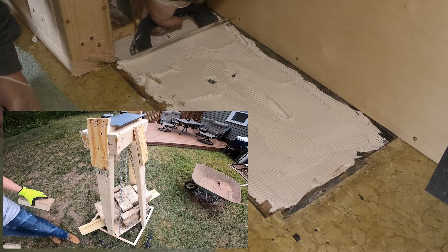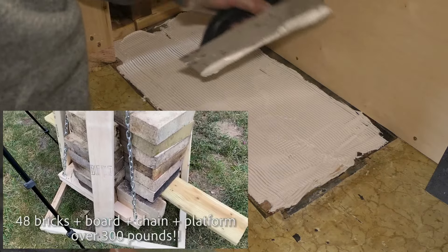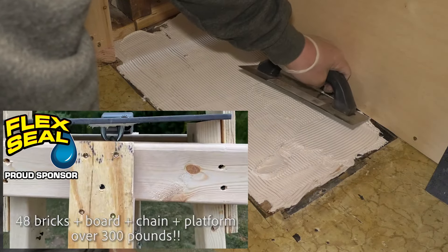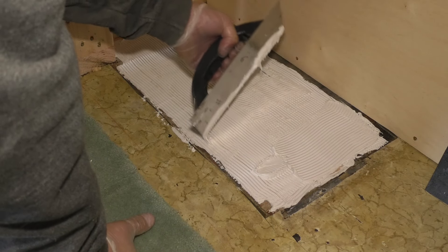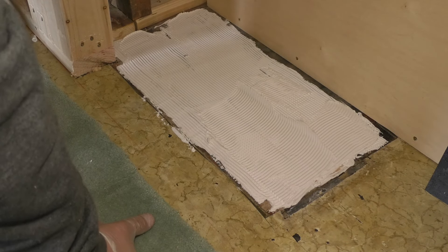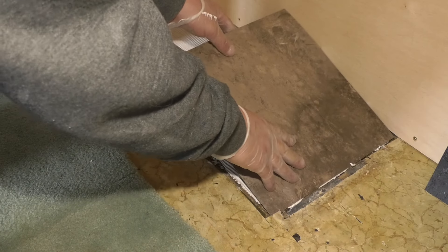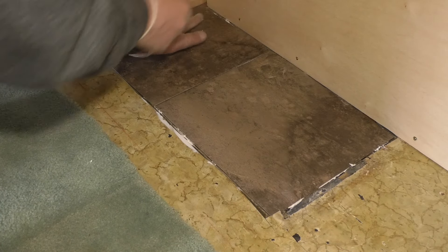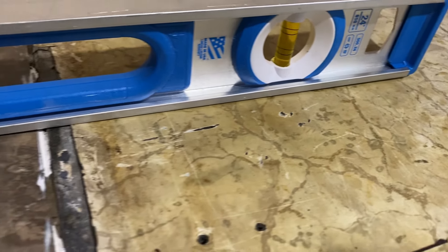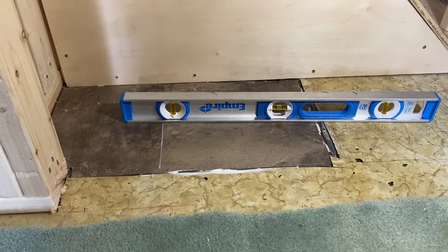Here's what I decided to do before I put those tiles in. I got my V-notch trowel and I just took a bunch of Flex Glue and I'm going to glue this entire thing so that the tiles won't move around. They shouldn't crack like they did before, and this will fill in any of those voids, any of those gaps in between the plywood and the other floor. If Flex Glue can hold up 300 pounds of bricks, I think it can hold down this stick tile. Seriously, I tested it. I love this stuff. Thank you again to Flex Seal for sponsoring this video. Adding those tiles made all the difference. That is perfect. Moving on.